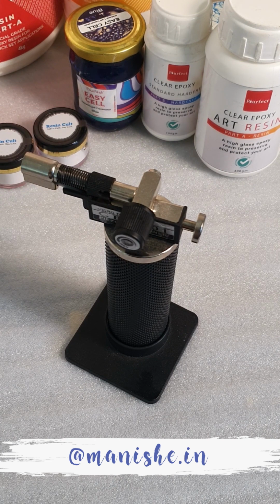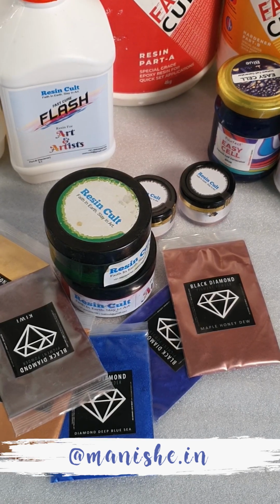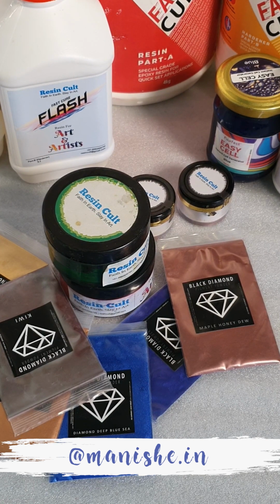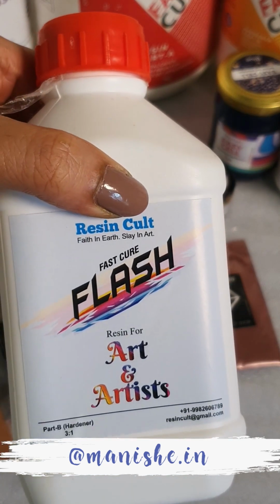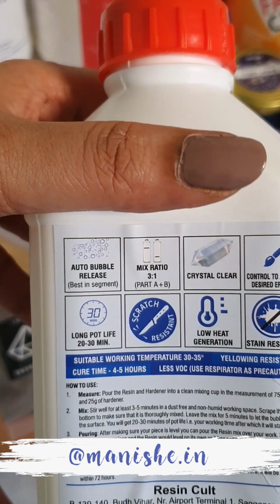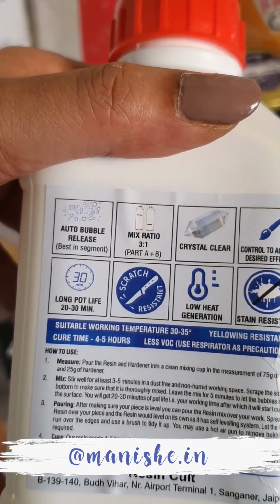Warm and dry conditions are conducive for resin work and curing. In India, 27 degrees to 35 degrees is usually all right. Humidity should be below 50%, and one must make sure that the temperature remains stable throughout the curing process. If the temperature does not stay stable and it fluctuates, the resin will cure inconsistently and form dimples. The first 24 hours are very crucial.